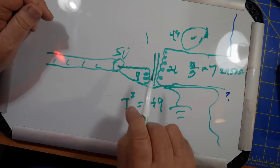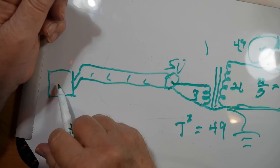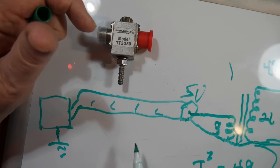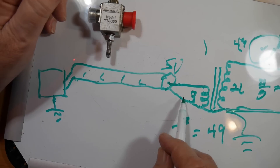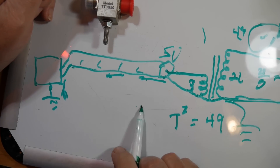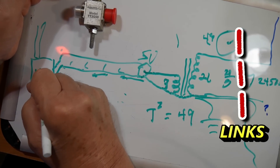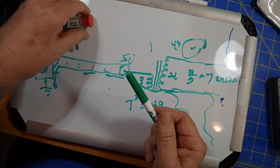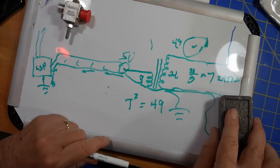What I like to do is use a fairly long piece of coax — like 50 feet — and then bring the coax down to a lightning surge protector. That's one of these right here, and this is mounted to ground. What's grounded here is the actual outside of the shield — the outside of the shield is where you're getting stuff that's looking for a counterpoise. It's coming down the inside of this, and it's shorted to ground here, so it won't go beyond this. You can take over and run this into your radio without an issue. These are extremely simple: there's just a little spark gap inside, and the coax side of the connector is attached to ground. This usually works very well.